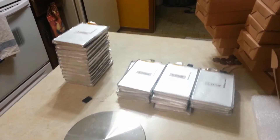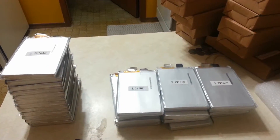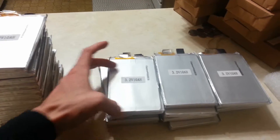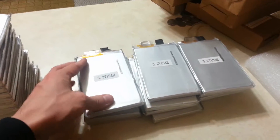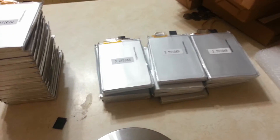This is going to be a fun project, but it is going to take me a little bit because of one other major thing — I can't just throw these all together, and this is the one downside of having to do this myself. Most of the time with lithium batteries, you're going to hear about something called a BMS, or battery management system. What it does is it keeps all of the batteries charged individually so that you're not exceeding their capacity and causing these to expand, because this type will expand if they're overcharged. They won't start on fire the way lithium-ion batteries do, but if you bring them down too low, it'll destroy the battery's ability to hold a charge.